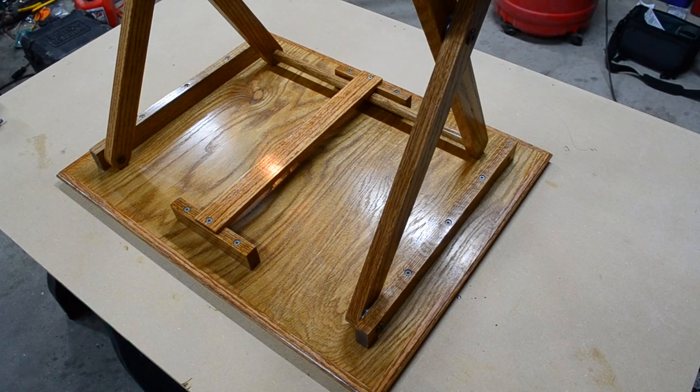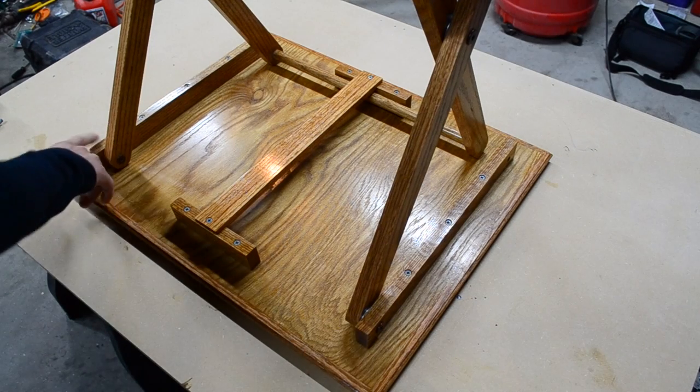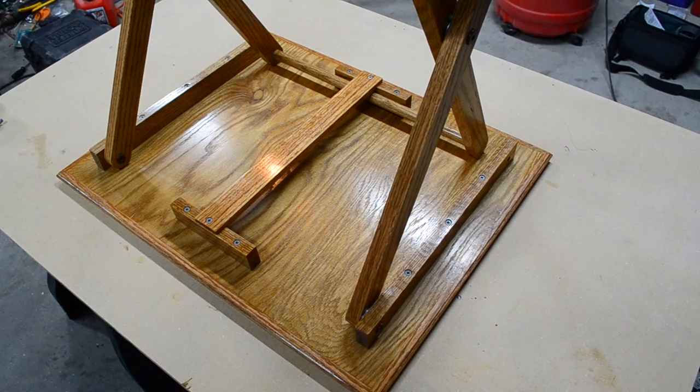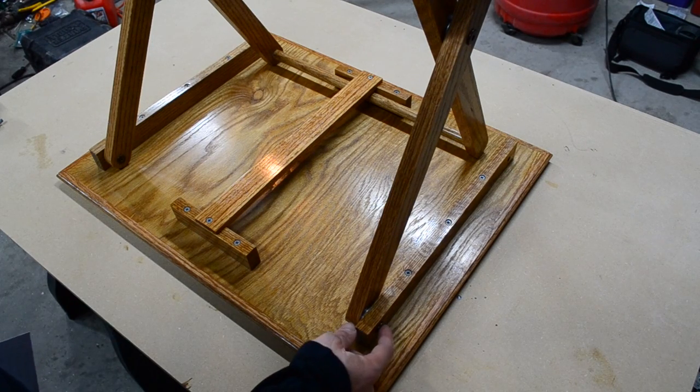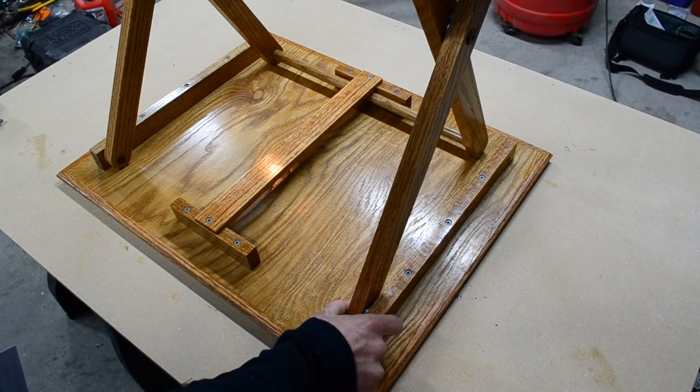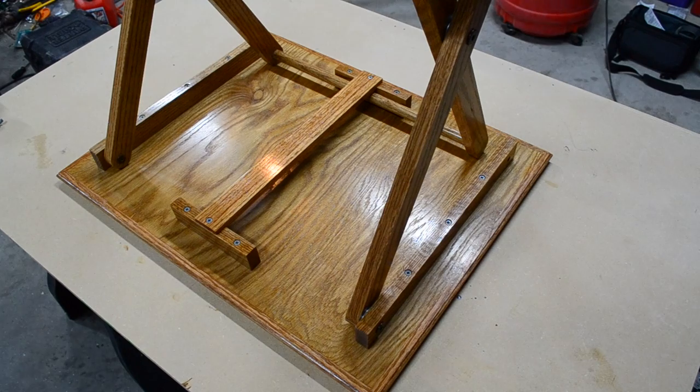Let me give you a quick rundown of how the bottom is going to be laid out, because this took the longest amount of time to figure out since I made this from scratch. You're going to have two side pieces — both 16 inches long — with screws countersunk at 4, 8, and 12 inches along the way. You're also going to have one inch from the end on each side where you'll drill a hole large enough for the mounting hardware to go through. I have it drilled out on both sides just in case I ever want to switch which way the legs are facing.